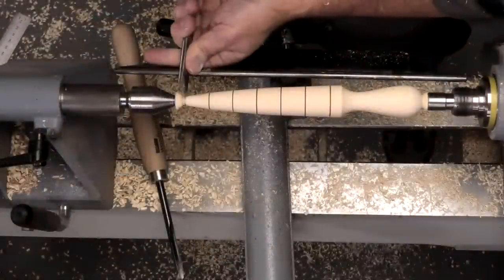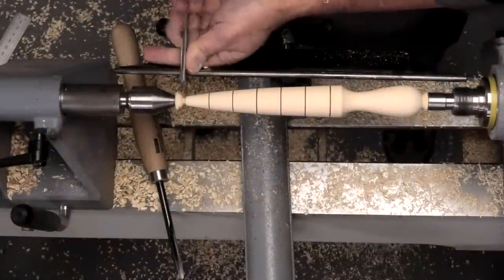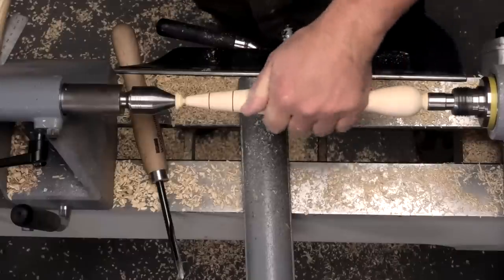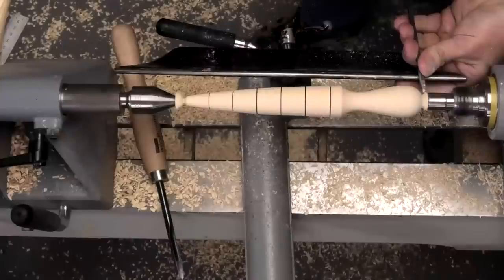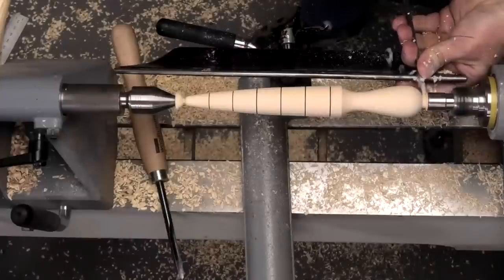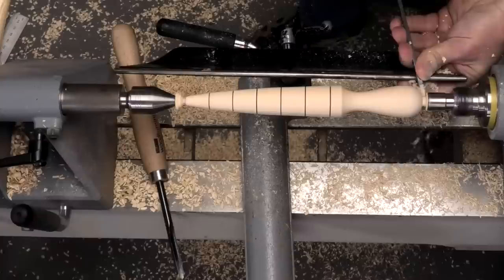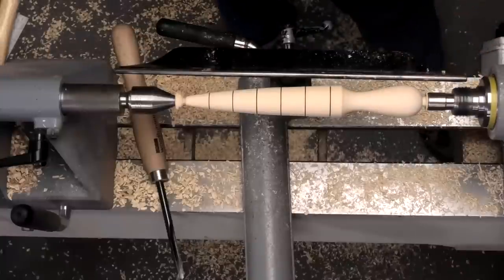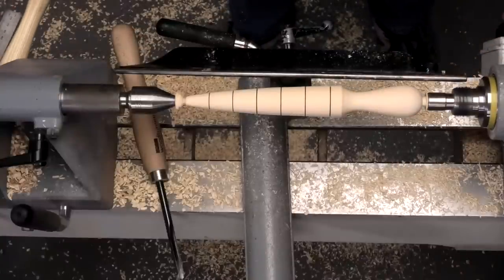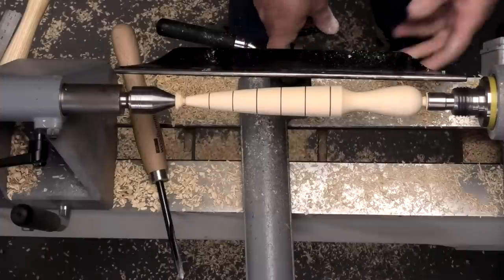So just the tip of the skew first. So that's taking that down to about 3 mil, so about 1/8 of an inch. Now I can get the parting tool in quite close. And that's now left, that's probably about 7 or 8 mil. So let's cut that off